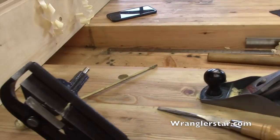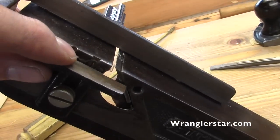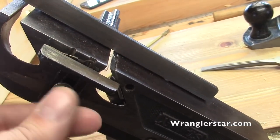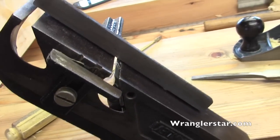So we've got to set up the tool a little bit different. The 78 plane right here — right there is a little cutter. This here is the depth gauge that controls how deep we go. I'm going to take this off and show you how this works and how to set that up for cross-grain planing.